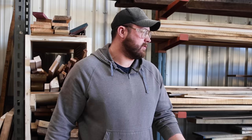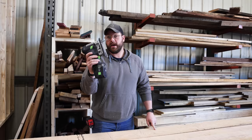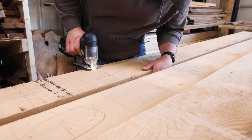I've got a rough stack of red oak here - what they said is eight quarter, a little heavier than two inches. We're gonna use this to build our door. This thing's gonna be hefty. Quick tip: if you're cutting your parts down to rough size, bust out a jigsaw - don't bust out a circular saw. The blade in a circular saw is much more likely to grab, and because everything's not square it gets to be a little more dangerous. Always grab your jigsaw.